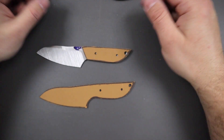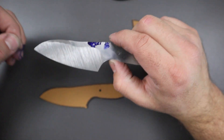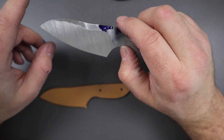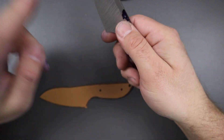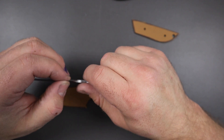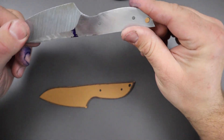This should be pretty repeatable, which I'm happy about. Unfortunately when I took it off the jig it fell and I knocked the tip off, but it should be perfectly fine once I get it down to the full grind — this isn't the final grind. After heat treat, I plan these to be fully flat ground, so the grind is going to go all the way up to the spine. Right now it's about a three-and-a-half-degree bevel, so I'll probably bump it to about three degrees, or whatever it takes to get up to the spine. Overall pretty happy with how it came out.